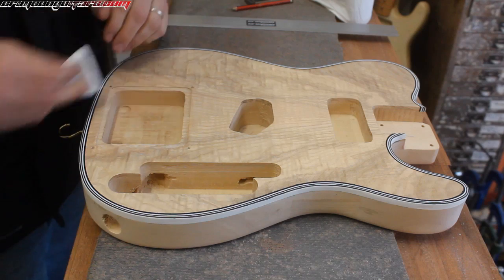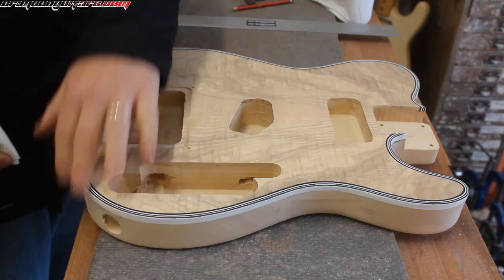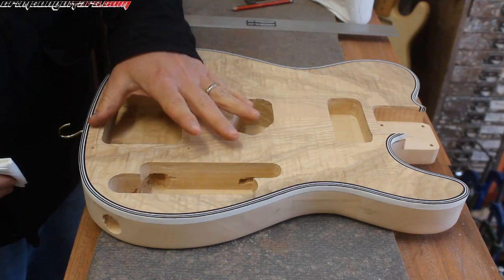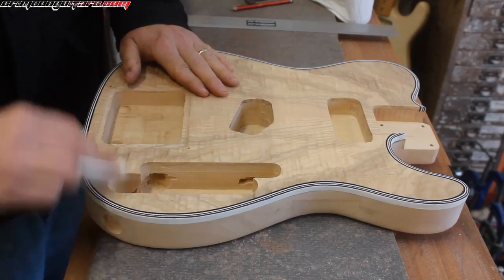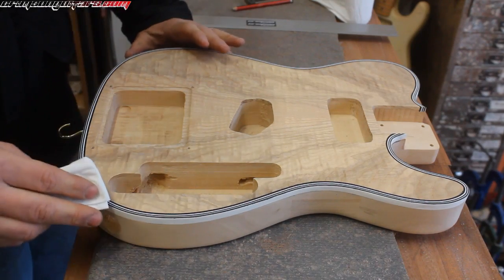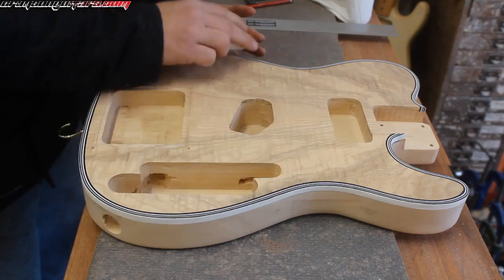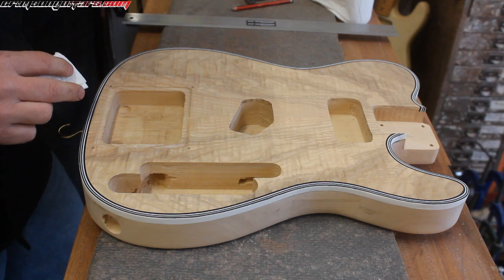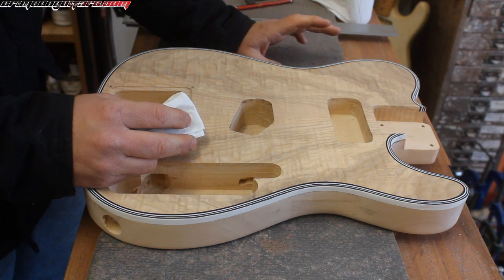to apply the oil. When you're doing the top, don't let it drip over the sides, because you might end up with a drip mark, especially on your initial coat. So you need to work from the center to the outside when you get to the edges. It's always a good idea when putting the initial coats of anything on, stain or finish, to go with the flame, which will hide any streaking, etc. That's more of an issue when you're doing a black stain or something like that.